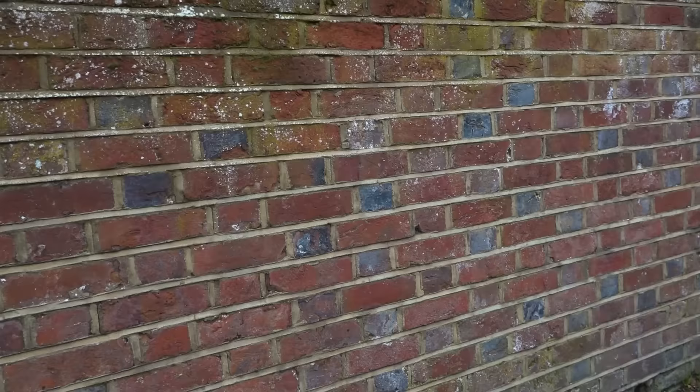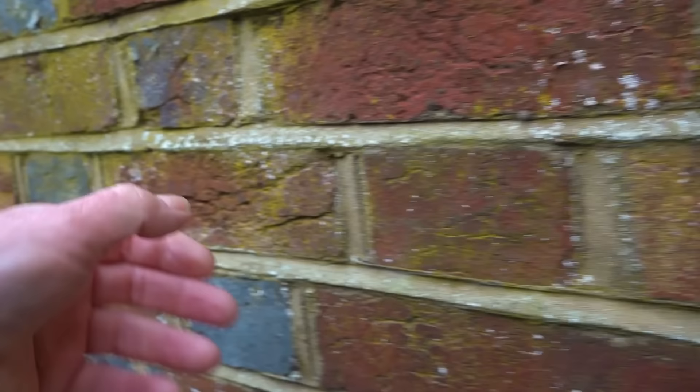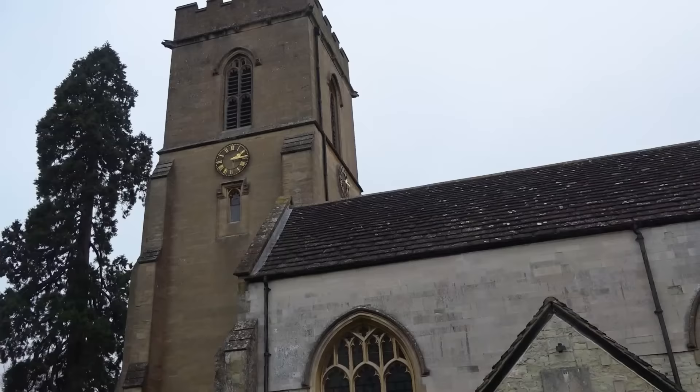So here's a bit of repointing done on very old sand and lime built brickwork. The guys have come along and done a nice job - there's a nice bit of weatherstruck pointing, but very hard mix, way too hard in my opinion. These guys I stopped and had a chat with 25 years ago - they used a tuck pointer, and that's what turned me on to using a tuck pointer rather than a little pointing trowel. There's a bit of spalling there on that brick, but I reckon that spalling was there before they used the sand and cement. I'd put a bit of lime in it, and you can see a bit there where it's fallen out, so maybe there's something to be said for using sand and lime on it.